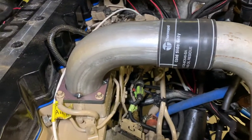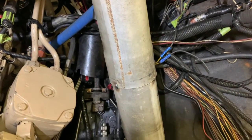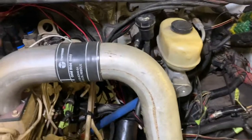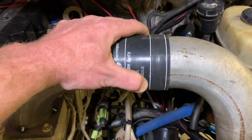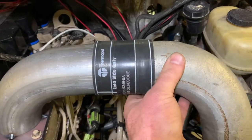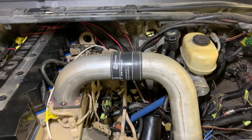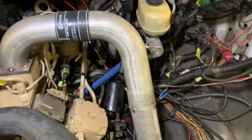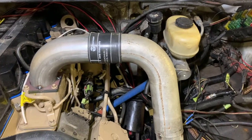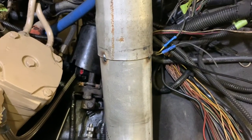We've got a couple of tacks on our 90 and also on the slip joint. All the boots are indexed the way they should be. There's a little bit of gap between the two pipes so we can put a clamp here and a clamp there, and this will move independently of our 90. Now we're going to take these components out, jig them up on the turntable, and put a nice clean robot-looking weld around each joint.